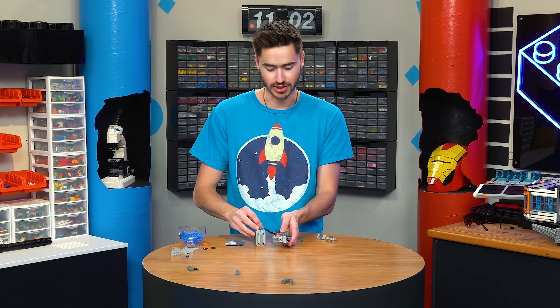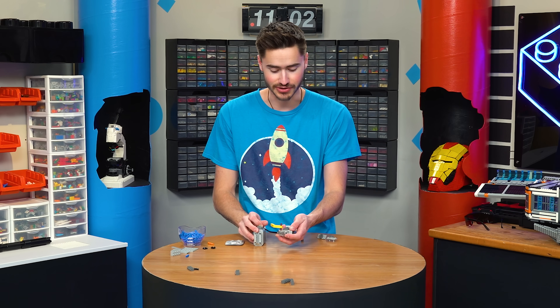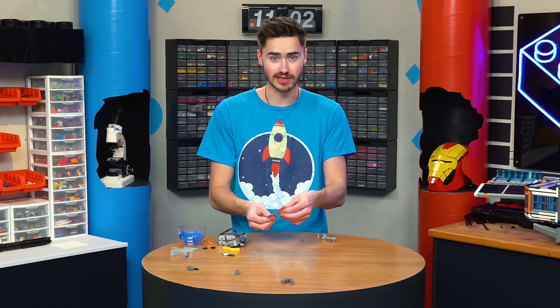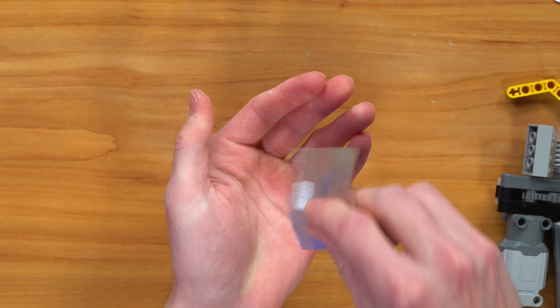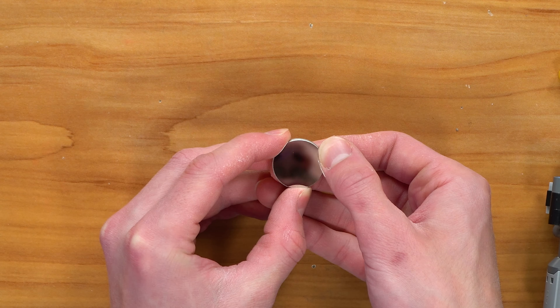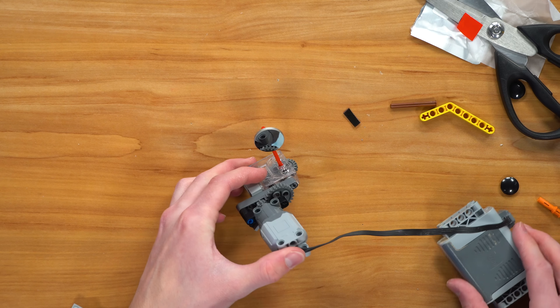So now we have two gear ratios, and as you can see, this thing is spinning really slow, which should give us enough precision to angle the laser. And to make sure we're reflecting the entirety of the laser beam without losing practically any light intensity, I'm going to use one of these precision mirrors that's actually made for CO2 lasers — this thing reflects over 99% of visible light.